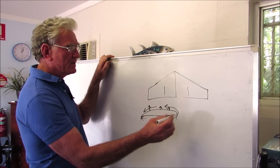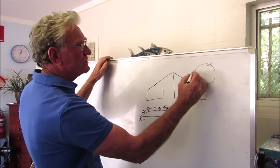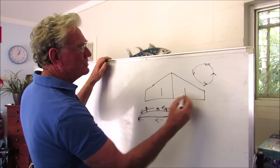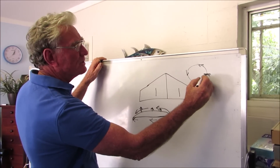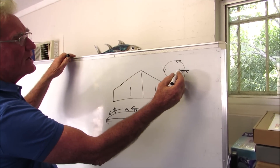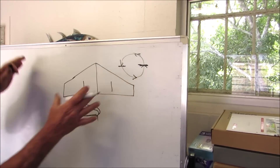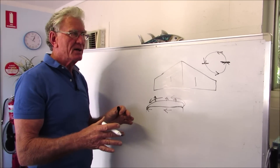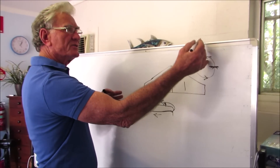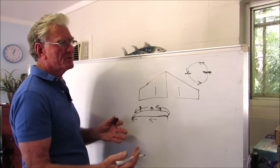I found that with the tumbling motion of a wave, the foil coming into the back of the wave — spread across it — was producing lift, and as it came through the front it was coming down. That poses the problem of what they call a sea crash. When the boat comes into the back of the wave, it lifts the front, it lifts the foil, and then as it comes through the front it brings it down — so the boat crashes.